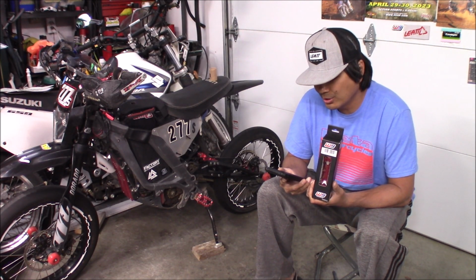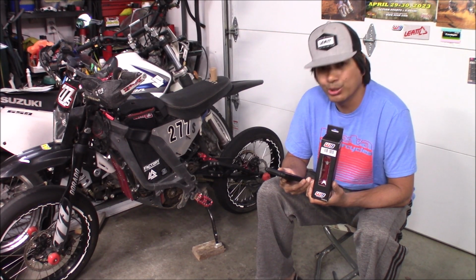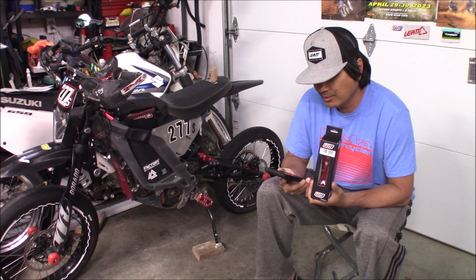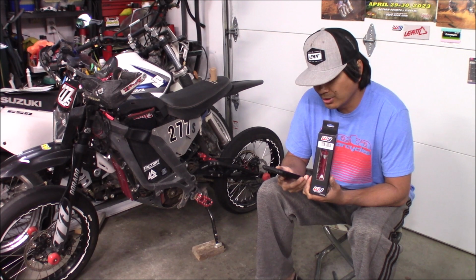So it is a greasable Jackshaft. It has 2 offset grease ports, so you don't have to take it apart to pack it with grease. It includes snap-on grease port covers. It's made out of a 7075 T6 aluminum main body. There's a zinc-plated carbon steel distance tube, and it has 4 high-load NSK bearings. They're 6000 RS bearings, custom-made ABEC 5 bearings.